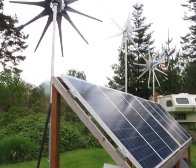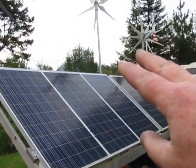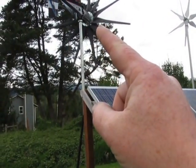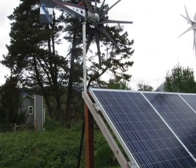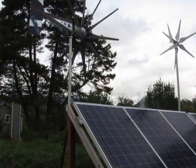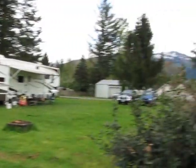Thanks for watching. If I actually get some good winds and start making some power, I'll show you guys. I got another 600 watt 10.8 to 30 volt grid tie on order, because I'm going to start separating out my turbines — it's like 1200 watts each in grid ties. For this guy I got a 22 to 60 volt on order and I'm going to get two of those, plus another 10.8 to 30 volt 600 for him. On lower winds he'll run the 10.8 to 30, and in higher winds he'll go on the 22 to 60s — 2000 watts worth of that. I always like to overdo my grid ties, have way more than I need, because they run cooler.